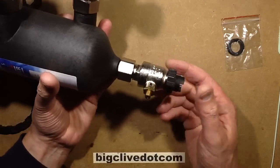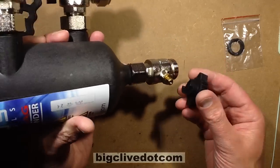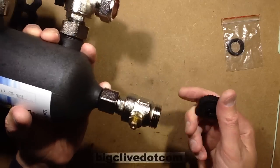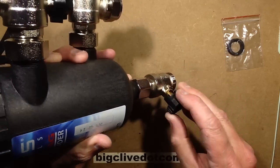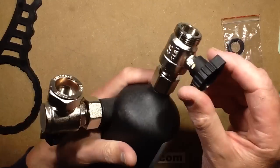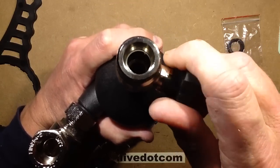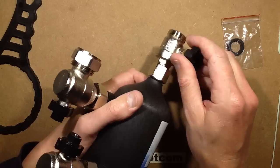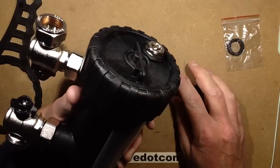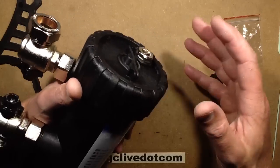Then you can open the bottom valve. To do that you unscrew the cover on the bottom, which also has a sealing ring for secondary protection. You put this cover over the ball valve and rotate it — it's made of plastic, a bit fumbly. The idea is that it's probably designed to deter kids from playing with it. You open the bottom and drain it down, and to help drain it you've also got a typical radiator venting thing. This is such a big unit that it involves huge movements every time you handle it.